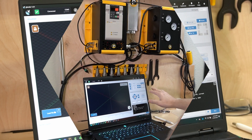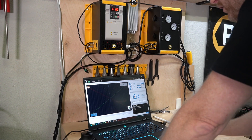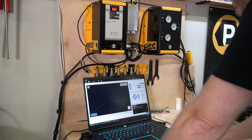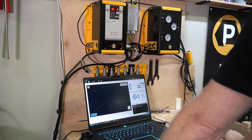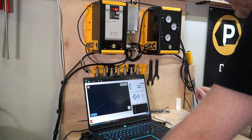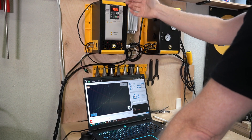Pull up your console and we'll be able to test it. In the console section, go down to the enter G-code commands field and for testing purposes enter M3 S6000. After hitting the command, you'll see the VFD switches from blinking to solid and then spins up to 6,000 RPM. Then enter S12000 and it spins up to 12,000 RPMs. Enter S10000 and it drops down to 10,000, or literally within a few points of it. Then S8000 drops down to 8,000. Hit M5 to stop.